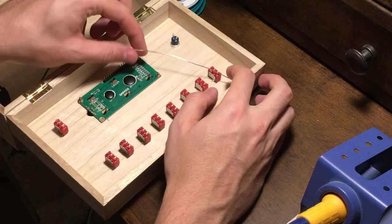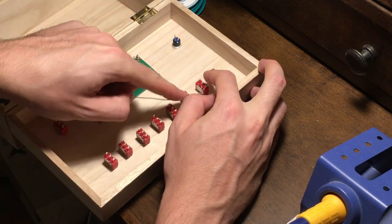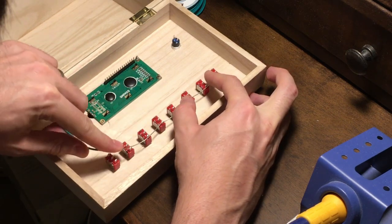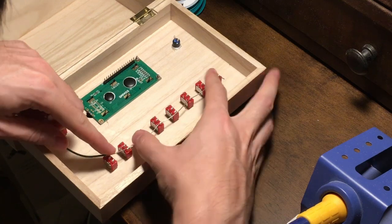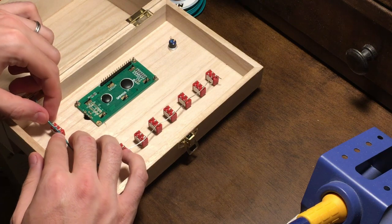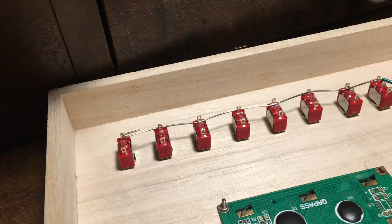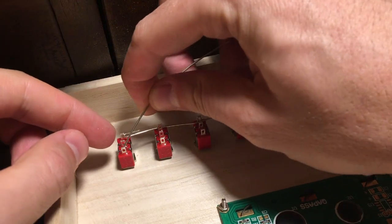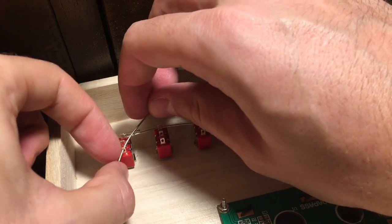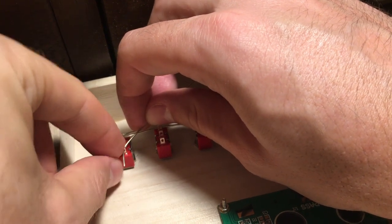Now, to make the positive and negative rails, we use the outer terminals of each switch. I found that 20 gauge wire was just the right mix of bendiness and sturdiness in this situation. Here, I'm taking care to grapevine the wire up and down for added rigidity before I solder it. 20 gauge wire just manages to fill the eye of each terminal, so I left a little extra length, since that would be a great place to add a little extra solder.